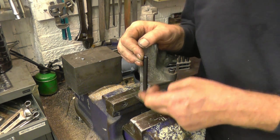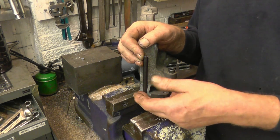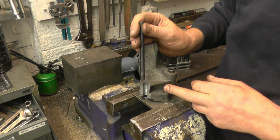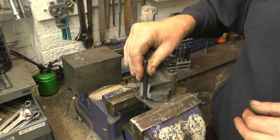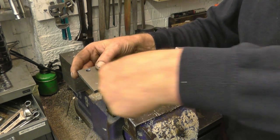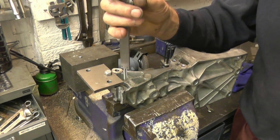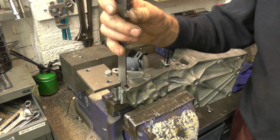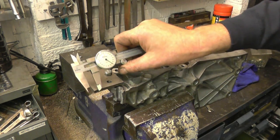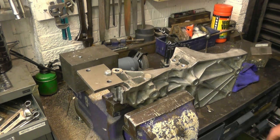What I could do is put an 8.5mm pin in there, weld around the pin, and put a helicoil in — but I'm going to machine all that out, grind it all out, weld it up solid, and then re-drill and re-tap the hole. I'll screw the jig onto there and measure the height between this plate and the bottom, keeping the vernier straight. 480 thou — I'll write 480 on there so I don't forget.